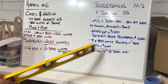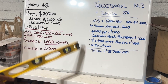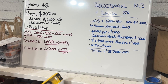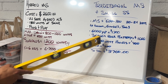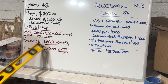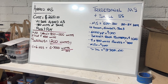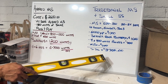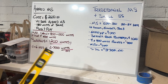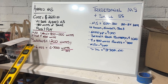At the bare minimum you're looking at about $3,700 for the mini split, EG4 6000XP inverter, server rack battery, four panels, and miscellaneous supplies — roughly $1,000 to $1,500 more than the hybrid mini split kit. But the benefit of spending that extra $1,500 is you get to utilize the full solar output. That 1,200 surplus watts gets dumped into a battery instead of wasted, and you can use it to power your fridge, lights, and other appliances.